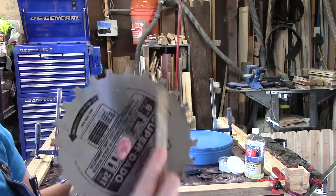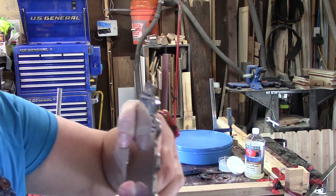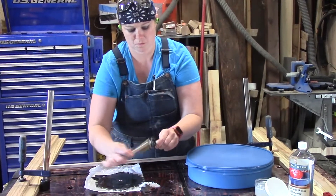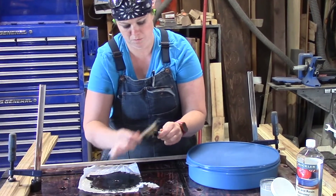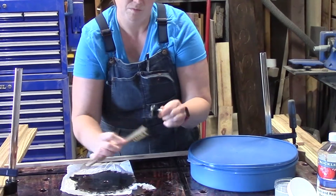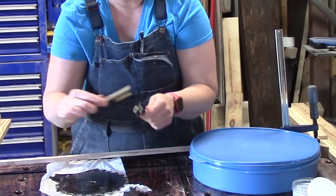You can see some of the marks coming off right in front of your eyes. Once I've gone through all of the teeth I start working the front, making sure the very front of the teeth is clean. Your router bits will be very similar, though some bit shapes may require more work. This one has multi-blade carbide tips and some of the resin got stuck in between the blades so I was using that brush to get it out. Other router bits are normally two or five blades and a lot easier to clean. I thought this was a good test for the cleaner to see how well it dissolved the resin.